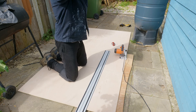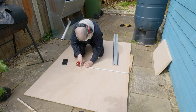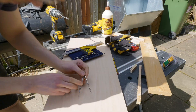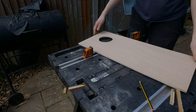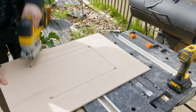That's the basic design. Here's the full sheet — I'm going to use about half of it. The whole sheet cost me £36, so it's only about £18 in wood. I'm using a router to cut out the vent holes and exhaust hole. I'm also using some new cordless DeWalt tools for this build, including a jigsaw that was absolutely amazing to use.